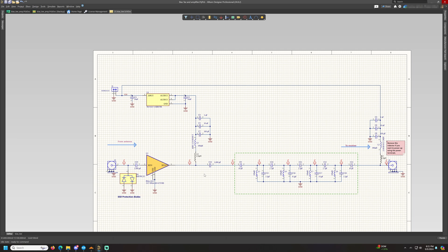Here I'm showing you the schematic of the LNA. It's a simple LNA circuit with two bias Ts. The second bias T allows you to power the entire LNA through a single coaxial line. This LNA has a bandpass filter to select the 125 to 160 MHz VHF band, which covers the two-meter amateur radio band, the LRPT satellite transmissions, and the air band.